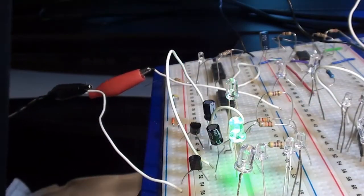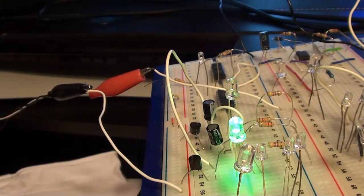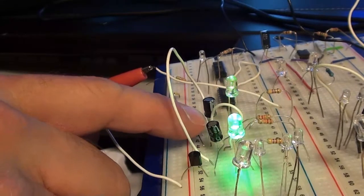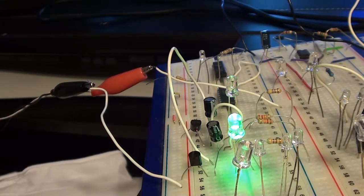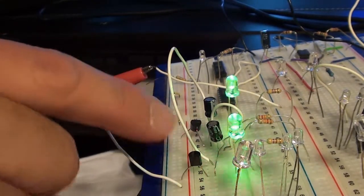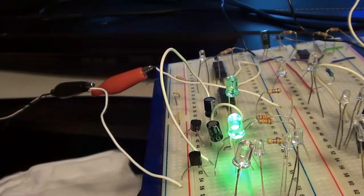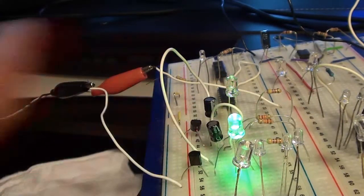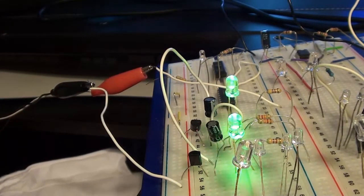What you are looking at is a blinker circuit. This blinker circuit is not driven by an IC chip — it's driven by two transistors, right here. The blink rate is controlled by these capacitors and the capacitor-resistance combination, because these capacitors hook up to one end of the transistor, and the other end of the capacitor goes to a resistor. The discharge rate of the capacitor is what causes the blinking — it acts like a solid-state switch, switching back and forth depending on the voltage applied by the capacitor.